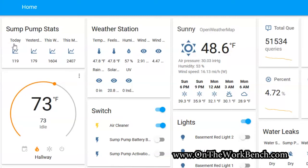At the end of the day, what I want to show in this video is that you can tie in the sump pump stats to show exactly how many activations have been going on. I can even query this to know how many activations over the lifetime since I set up the sensor, to give me some idea of how dry it's been. This also acts as a proxy measurement for how wet the soil is outside, because all this water is coming through the soil and into the sump basin. So that's a look at the last mile of connecting this all the way through to Home Assistant. If you found this video useful, give it a thumbs up, check back for more videos, and have a great day!